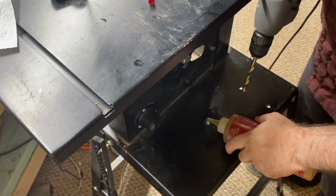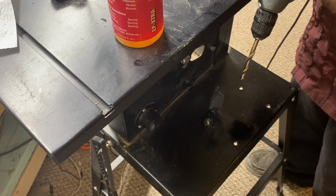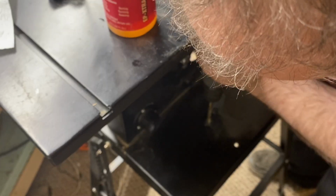As is typical when drilling in metal, I started off with a smaller bit and then switched up to a larger bit to finish off the size of the hole. My trusty drill bits are well worn and could probably do with some sharpening, and so I had to do a little bit of side-to-side motion in order to get the holes drilled.